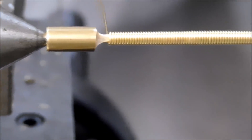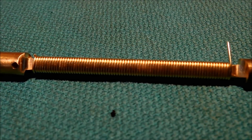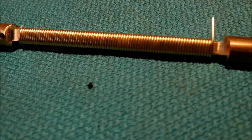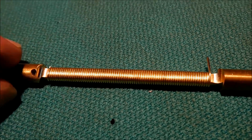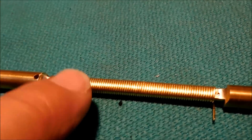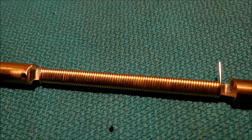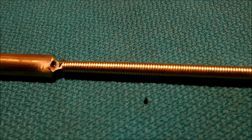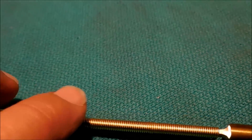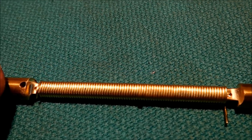Let's go over to the saw, saw this thing off, chop a few links off and show you what this will ultimately look like. There is no doubt in my mind that when you cut these links the memory of this material means the link is going to deform as it comes off. If you want to avoid that, gently tap this surface with a soft mallet or put it in a vise, but be careful how hard you squeeze it — you don't want to transfer the shape of these links into the arbor because then it's going to be a real dog to get off. I'm going to use the corner of the vise and just pinch it gently, then rotate it and pinch it gently again to establish a little bit harder corner, because I know this is going to open up when I cut these off.